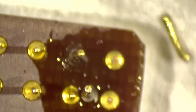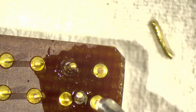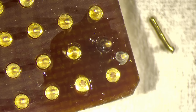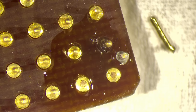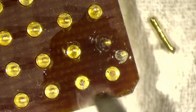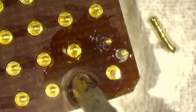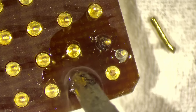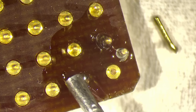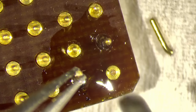Let's try to add at least some solder base here and then just try to attach these pins from the Pentium 3. So let's see if we can attach a Pentium 3 pin to a Pentium Pro. There is not much of the leftover pin here, so I think we can just add a little bit of a solder blob to build the base. And now comes the difficult part: aligning the pin here without touching anything. That should be golden.